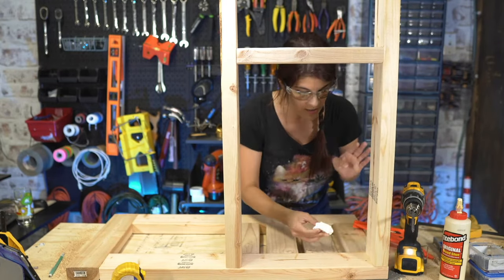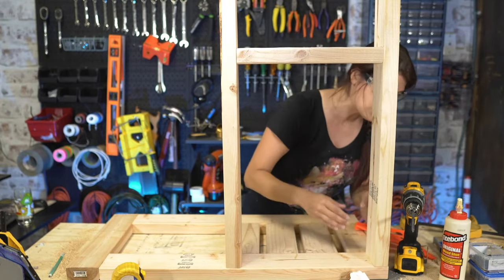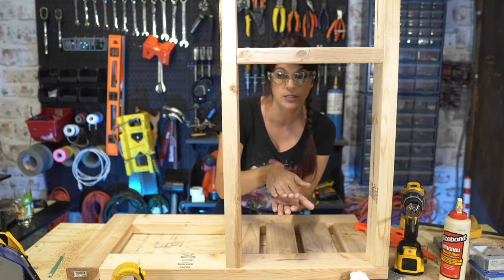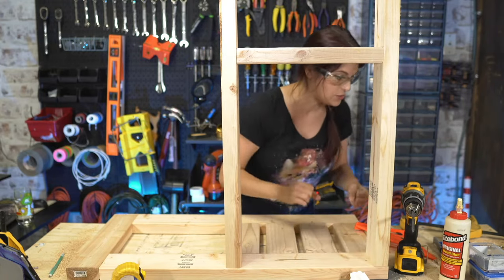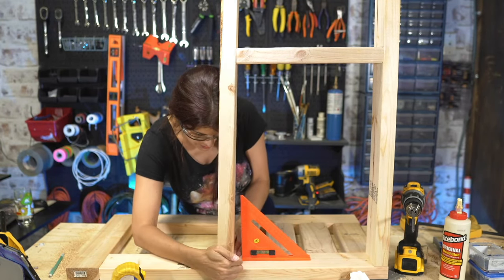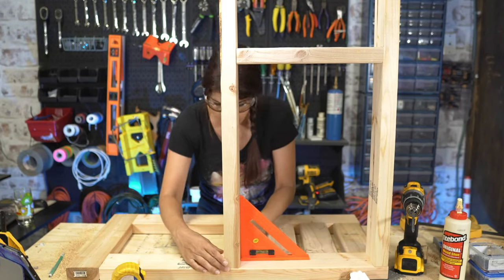But guys, I think that went okay. And when I screwed it in, the glue just went out the side. So I know I have a nice tight joint. Sometimes when you don't clamp it down and then you screw it in, it separates and you get this weird little gap. And that might be what Merlin is talking about at the bottom, between the top and the bottom of the thing. But it doesn't look like we have that here. So I'm like, yes, yes. So let's get this nice and square. And I want to try and budge it out just a, whoop, too much. There. And just get that so there's no movement on the square there. So that's nice.